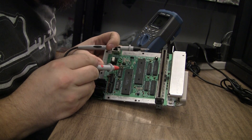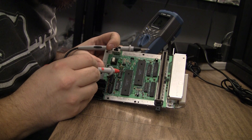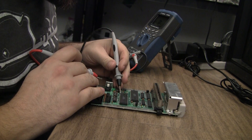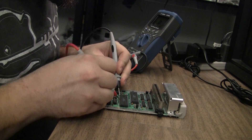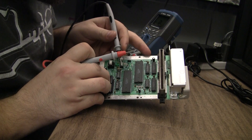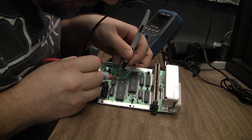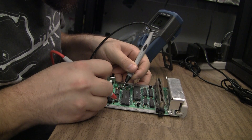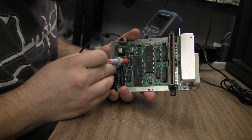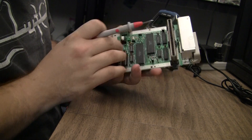With my multimeter out, if I look at that via right to the left of pin 21 it goes over here — looks like pin 30 maybe — and I do not get continuity, so I know that one's broken. There's another via right next to the transistor for the clock circuit that looks like it goes all the way over to pin 39, and I also do not get continuity.